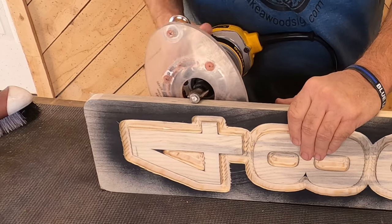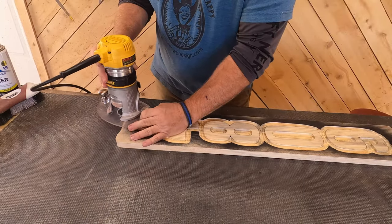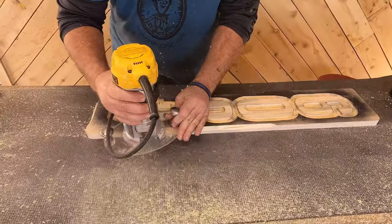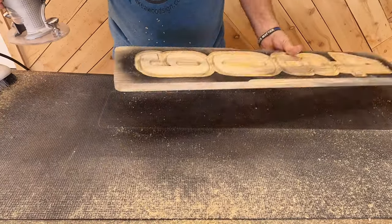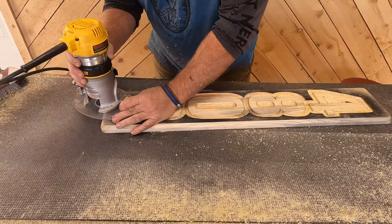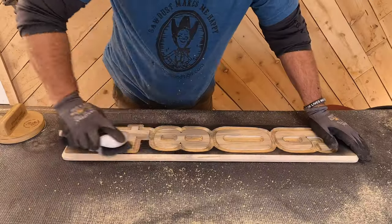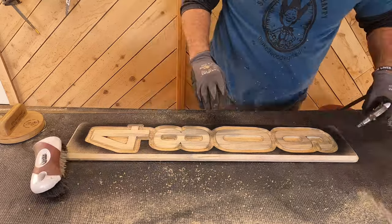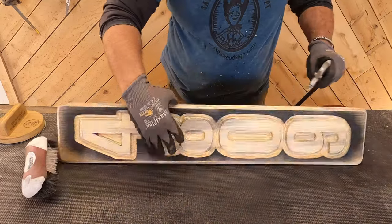The last bit we're using today is our 45-degree chamfer bit. Dad's measuring based on the board that he has — there's really no way to get a good idea of what the chamfer will look like using our depth gauge. He's putting a nice deep chamfer on the front, and then he's also going to put a small chamfer on the back, mainly to take off any sharp edges. And I think it gives it a smooth look. Don't forget to brush out your sign when you're done and get all that excess sawdust out.